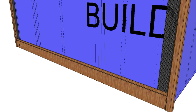overlaps. So this plinth board provides you that kicker to start with, and it also just reinforces the bottom of the weatherboards. Weatherboards are very susceptible to damage along the bottom if they get kicked or hit with a ball or whatever. So putting a plinth board in is not a bad idea. However, I haven't seen it done. It's not very common practice.